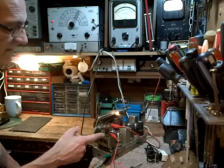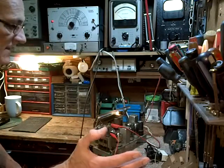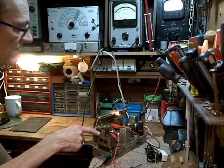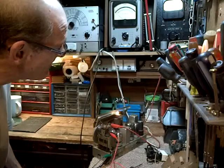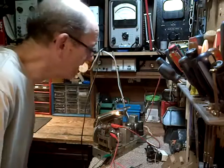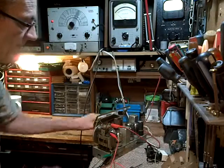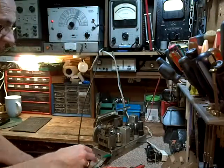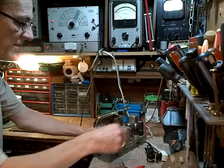And there's not much I can do with the antenna tuning part. I don't have the antenna, so I can't adjust the trimmer properly here. And I can't adjust the local oscillator, since the radio was provided outside of the cabinet and the pointer didn't even come with it. So I could only guess what the scale readings are, and there's no benefit in me doing that. So I think this little guy is done, except for putting the wire extensions on it. There's really not much more I can do here. So I will put these wire extensions on.